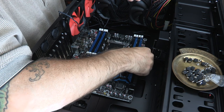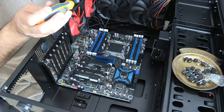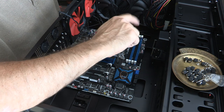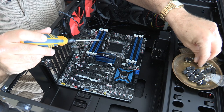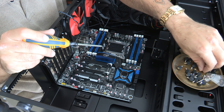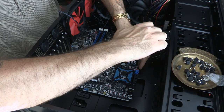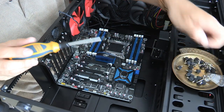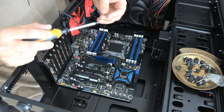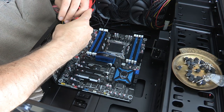This one's magnetized — I didn't realize that. I do that sometimes. I'll magnetize it so that it stays on there so I can get down in the holes. You can take any magnet that's got a little bit of power to it — not those little weak logo magnets, but a stronger magnet like with a clip on it, the kind that go in your refrigerator. You just scrape the end of this across it, do it for probably about a minute, turning it a few times, and the screwdriver will be magnetized when you're done. Then you can not worry about dropping the screws in.